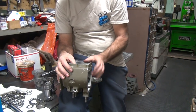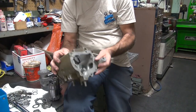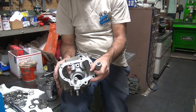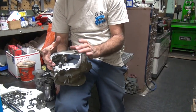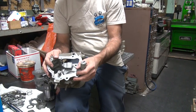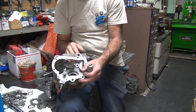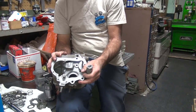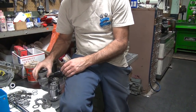But if you put the 39 point in there, that... See, it's a completely different tranny. It's the same design, but it's completely different. The diameters are different. This whole case is a lot bigger than the 40 tranny. This is 41. The center lines are closer together. Everything is just smaller diameter. So if you put the early one in there, it's probably going to not do what we need to do. But that's about the only thing I think of that might work and help us.